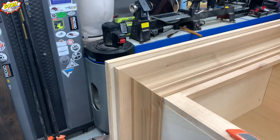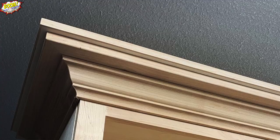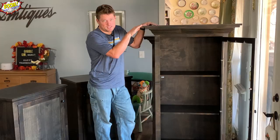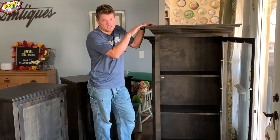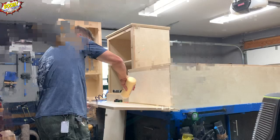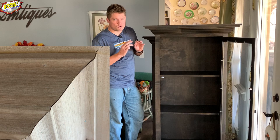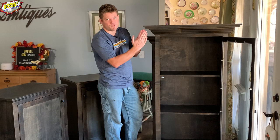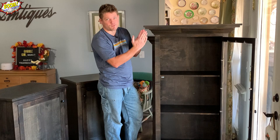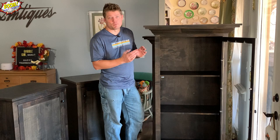The overhang is roughly about four inches on both sides as well as the front. The crown molding is a three-step kind of crown — you have the molding itself plus some mitered step blocks that give depth all the way up to the top. The top is a piece of plywood edge banded all the way around with a quarter-inch thick strip of alder. If you ever cut crown and your joints don't quite seal up, you can back-cut your miter so the front touches before the back, or you can take a screwdriver and run it over the joint until the gap closes up. Do a light sanding afterwards to take care of any inconsistencies the screwdriver might have left.